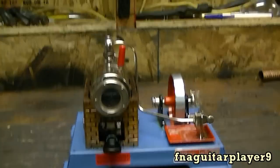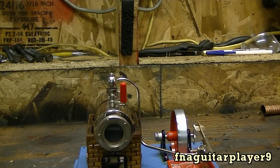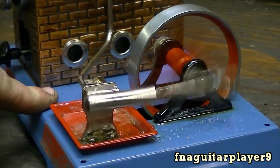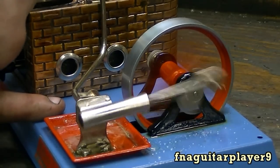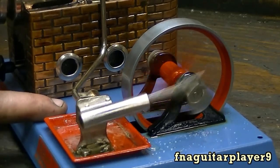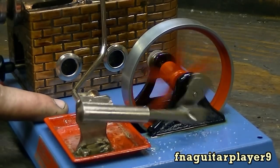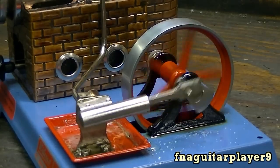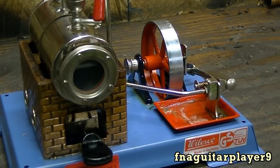It loses a lot of pressure when you run the whistle. I'm going to open the whistle up a little bit here to lose some pressure and we'll see how slow we can get the engine to run. That's about it right there. Some of the different models you can get actually have a valve here that you can adjust the speed with, like a throttle almost. I'll stop it here for a second and let the pressure build up a little bit.